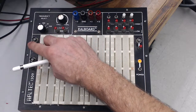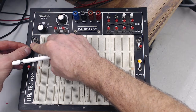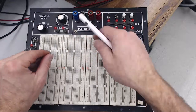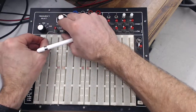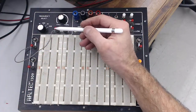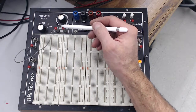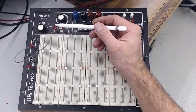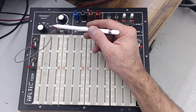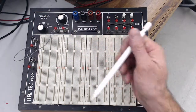You can use this to look at the clock, for instance. I've got a wire connected to the inside of this coax, and I can also connect that wire to the clock by doing the same thing on the clock output pegs. The clock is now generating a voltage on both — they're tied together and pretty much the same thing, slightly different in that one is down-going and one is up-going. The clock output comes relative to chassis ground, and I'm now sending it over to the coax.